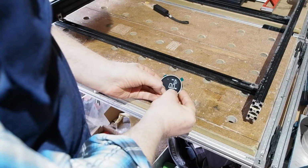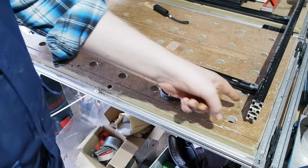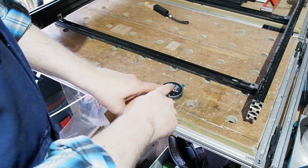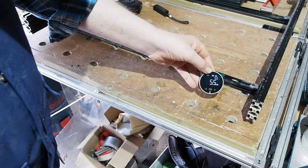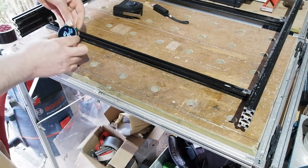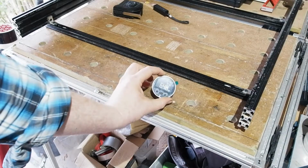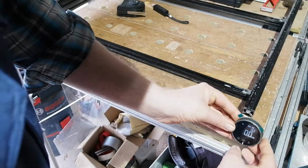As I said earlier, this mode allows for the width of the machine between enclosed sides, as obviously the centre mark can't get to the edge of what you're measuring. You can see here, start to roll, and it adds 5.5 centimeters straight away, the width of the measurer. As I run it between the rails of my router sled, it measures 646mm. I know these to be accurately set to 640mm, and again, several attempts to measure gave different results, non-bang on 640.